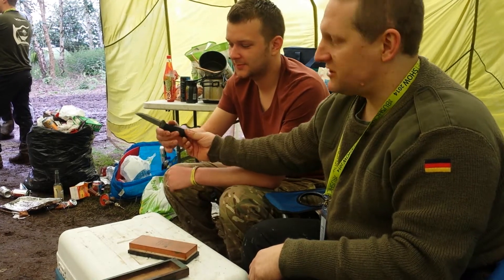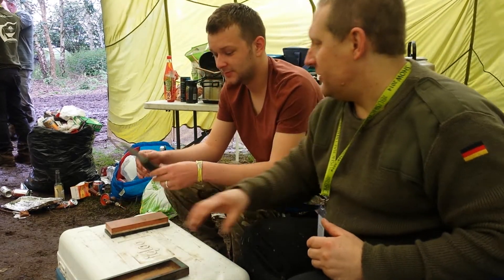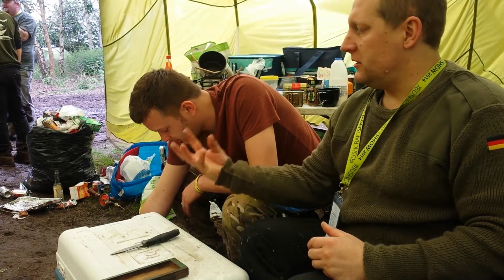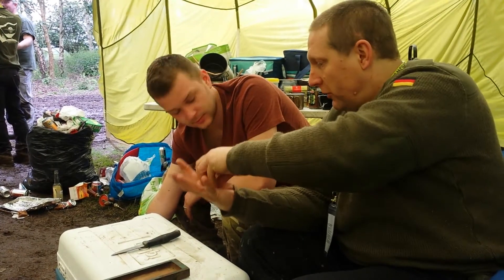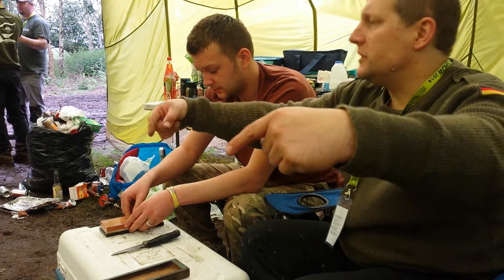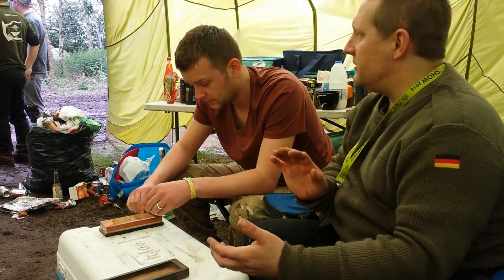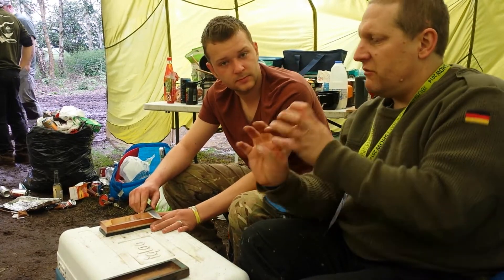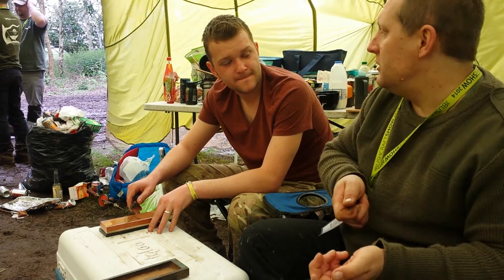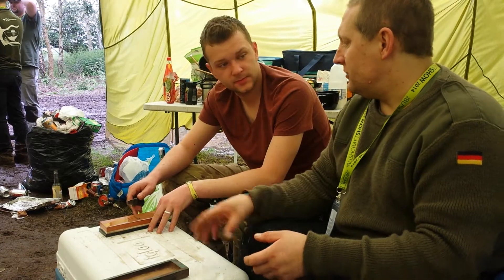Twenty times more expensive — now feel that edge for the same amount of work. World's different. So if you recharge that, have a play with it. Put it back in the water — now that is to clear the steel from the egg box bottoms, and there will be attrition on that as well. You're trying to clear it — a bit like if you had an angle grinder stone, every now and again those pits will glaze over because you've flattened all the mountain peaks off. So you put this thing called a stone dresser — it's like a convoluted arbor-type wheel — and what you can do is redress the stone, flatten it up and clear all the stuff that's filled the valleys in, to get the bite back.